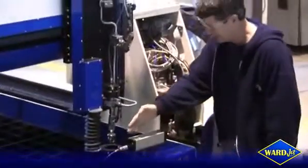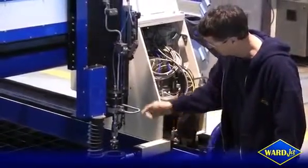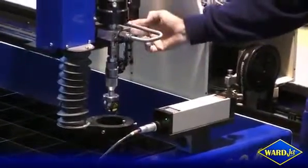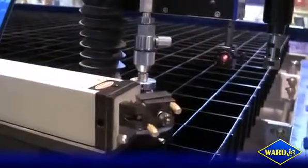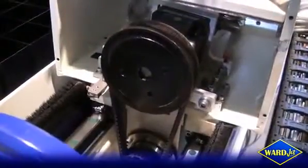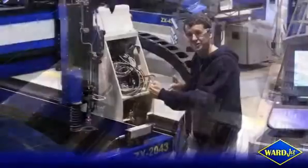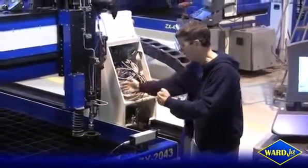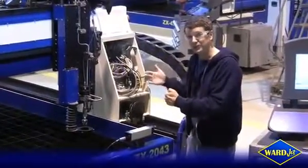The way that it works is a laser is projected through a mirror to a receiving mirror that's actually placed onto the machine. We'll tell the machine to move one inch, and at the same time that's tied up with the laser, which says it's expecting to arrive one inch away. It's then able to compare exactly how far we did get.